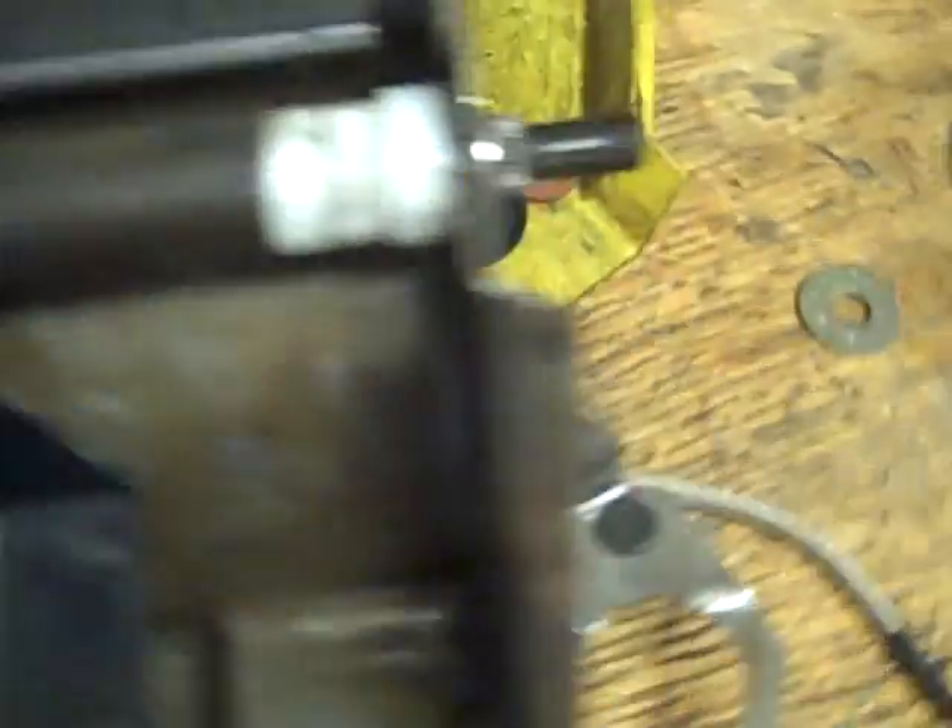Also, in order to not bind, I had to have this shaft come out a little bit further. So I loosened this nut to accommodate for that so I can get a little bit more sticking out the end. There's also a little bushing that was left over that wasn't chewed to smithereens — I trimmed that back just a little bit and tucked it back in.